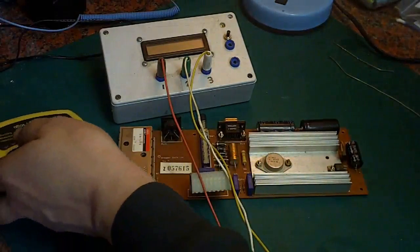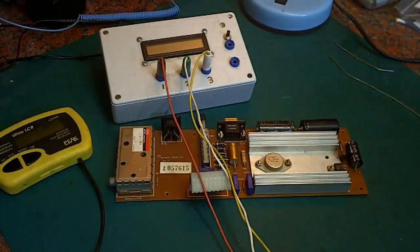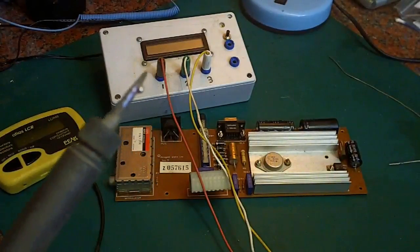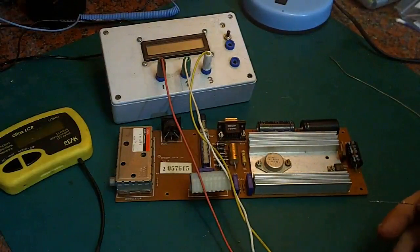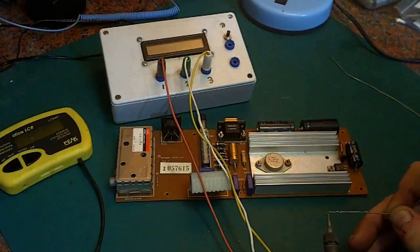Someone commented in that video about my soldering, and I completely agree. The truth was I hadn't cleaned my soldering iron bit — I forgot to bring some water up for the sponge and thought I'd just do a quick job. Someone picked up on it; my soldering iron was absolutely filthy. You shouldn't use a soldering iron looking like that because you're not going to get a good solder. As you saw, I did struggle a little bit, and my soldering wasn't the best — purely down to not cleaning my iron. You need to keep a reasonably clean iron tip.